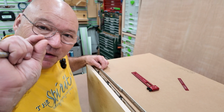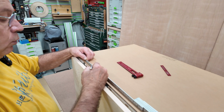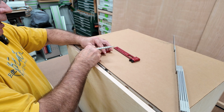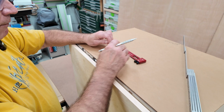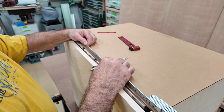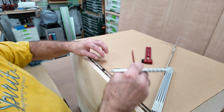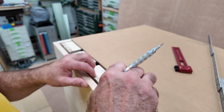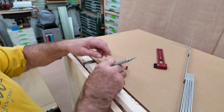Later on in the video, I'll show you how I give it just a hair fudge factor to do my rips. Okay, I'm going to come over here and hit, oh, look at that. This is falling into place absolutely perfect. So if I'm to gander at this moment, I think I'm going to have that really good spacing of, yep, look at that. Look how it fell in, 120 millimeter fronts. And it doesn't matter because that won't bump into here. So when I pull that out, no worries, it won't affect anything,